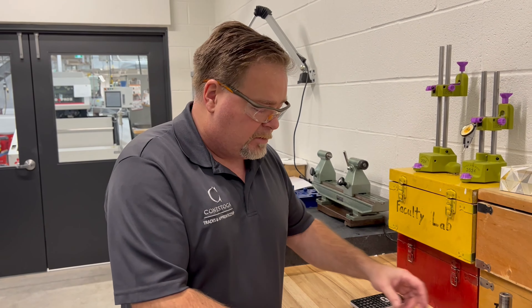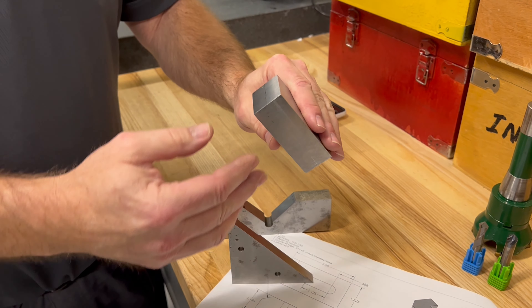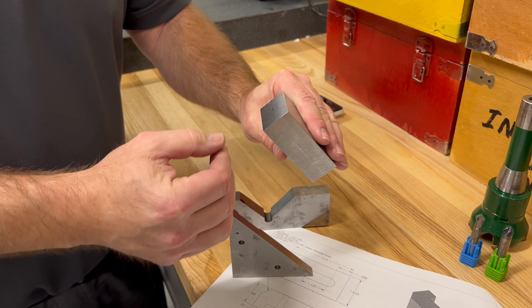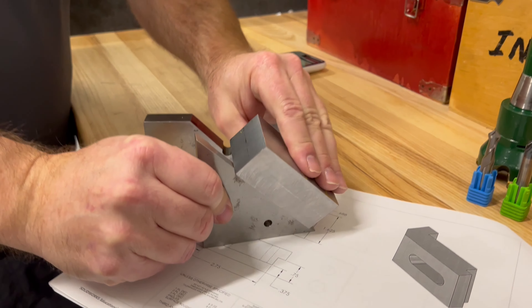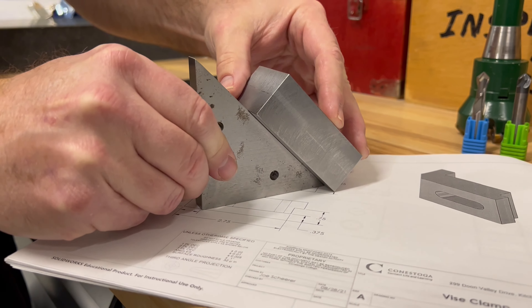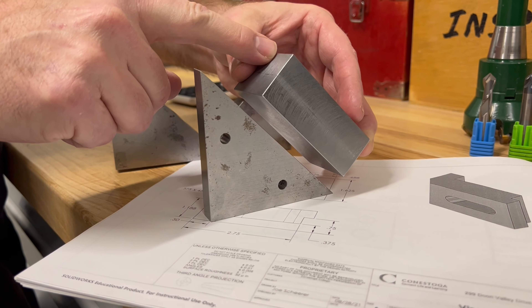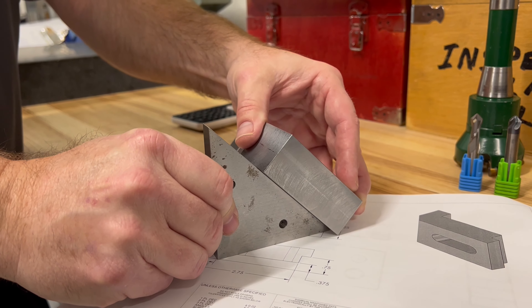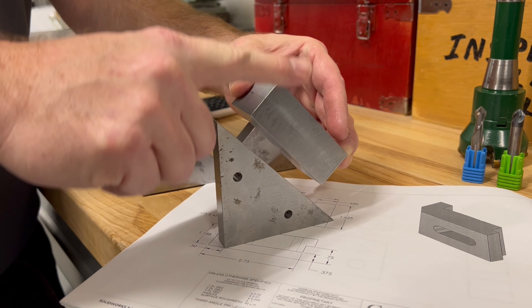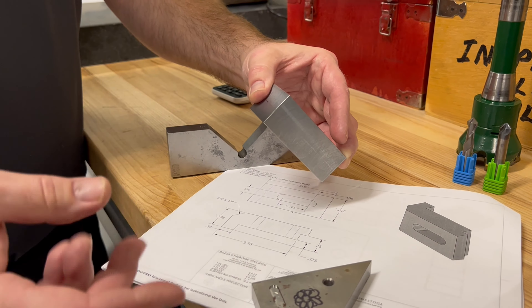So what we're going to do is put it into the vise on 45 to make this angle 45. We could also tilt the head of the mill to 45 degrees. This here is a 45 degree parallel and it's unseated. The problem with it being unseated is there's no repeatability. We have two of these to make, so with no repeatability I can have it up here or up there and I have to readjust my Z height every single time. We're going to go through the Z calculations in a moment.